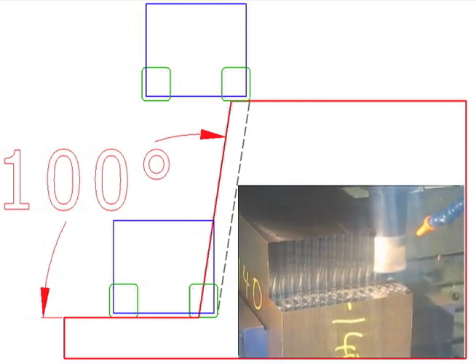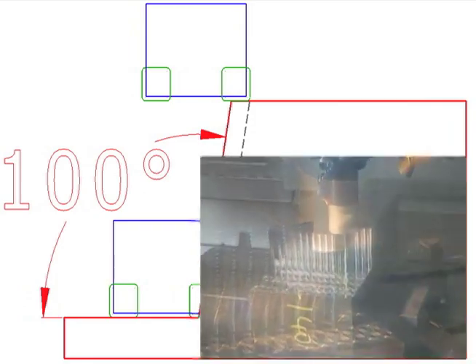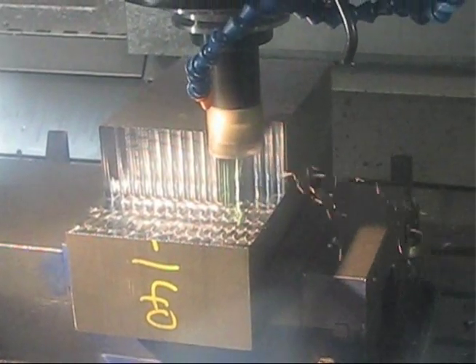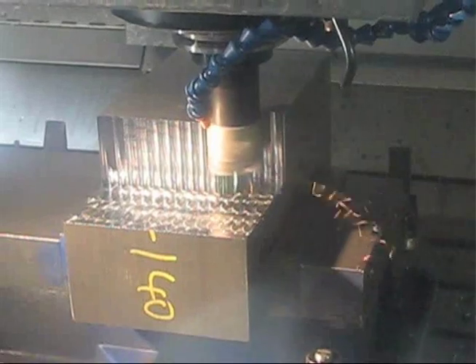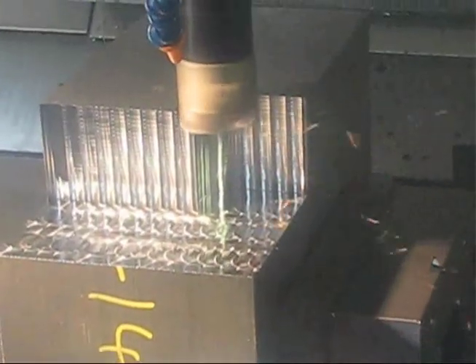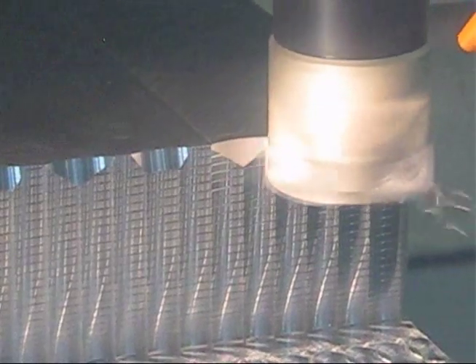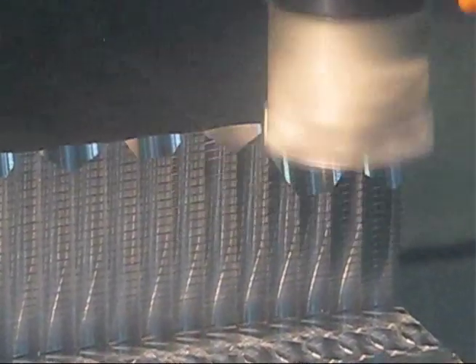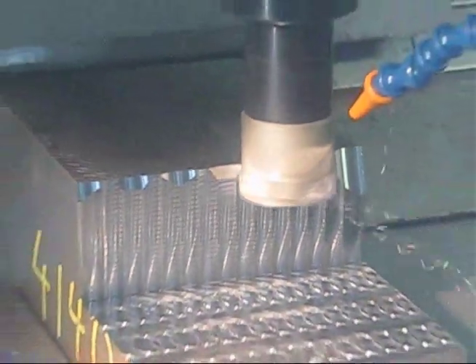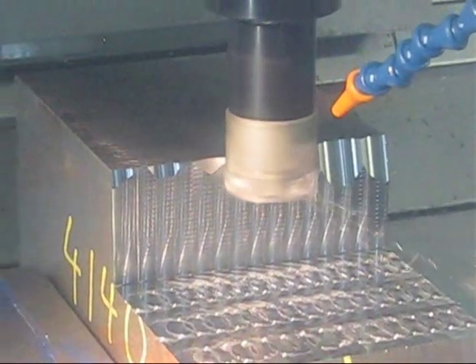Another example of plunge milling — you'll notice that the diameter of the tool holder is very, very close to the diameter of the cutter. You don't want to just grab whatever tool holder happens to be within reach. You want one that's going to give you the most amount of bearing surface, because there's a tremendous amount of thrust going up into that tool. You want to make sure you've got a significant tool holder that's not going to get squirrely and push off to the side.